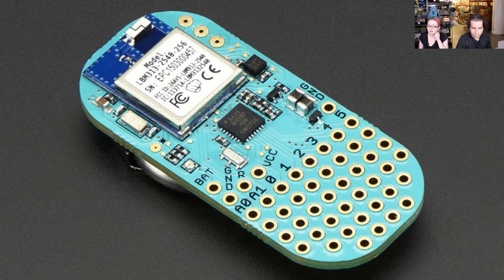Either way, it's wirelessly programmed, and the idea is you can use your iPad. You can also use a Mac or Windows 8 forward, or Linux to program the Atmega 328 remotely. So it's basically like an Arduino Uno compatible chip, but it's wirelessly programmed with Bluetooth and it runs on a little coin cell. And I can show it off.